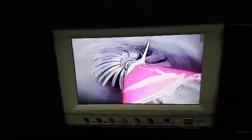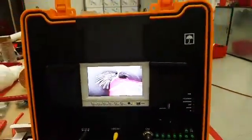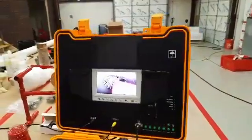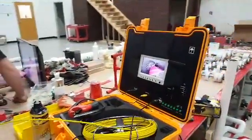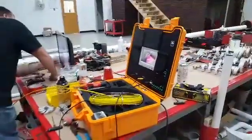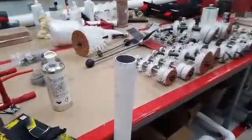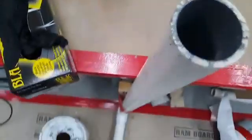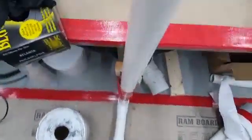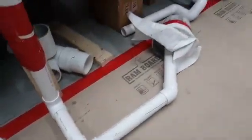So yesterday we installed a coat of white epoxy. Now we're installing the dark gray. This is a two-color epoxy. We're using that dark contrast of the second color to show exactly how well we're covering on the inside of the pipe as we go through. We just completed doing this two inch — you can see this configuration. These are two inch pressure 90s through a 45.